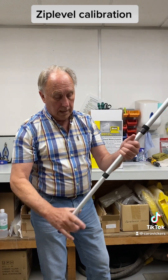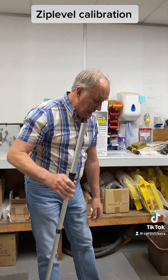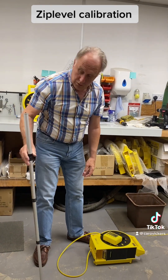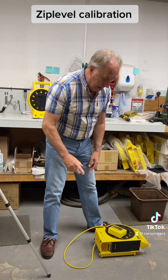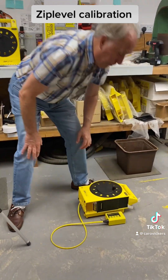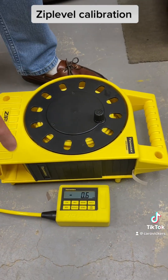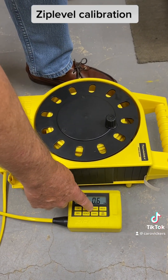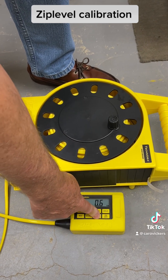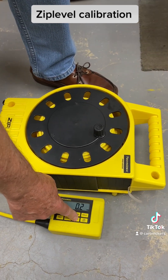Get that extended and you can check how accurate it is if you put the measurement module close to the base unit and then zero it, which you do by pressing the zero and holding it until it locks on to zero.